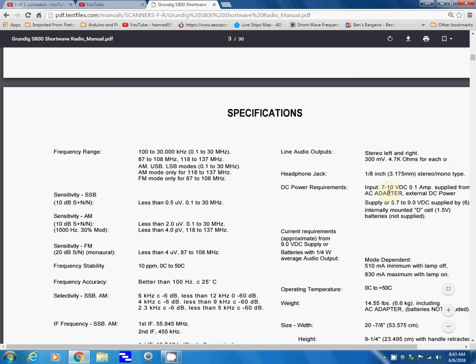So I'm going to do some more testing of that little power supply. I'm going to keep that resistive load on it, open the cover so that I can measure some temperatures of the components while it's being stressed and see what happens. Also, I won't measure the current, but I'll measure the voltage and see if the voltage drops off after it's been on for a while with that load.